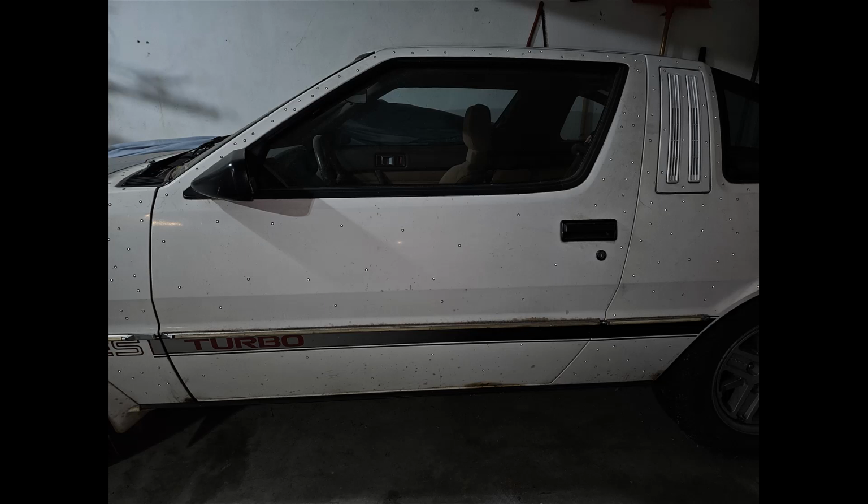Now, when we take a look at what's happening during a scan, this leaves a pretty large light pattern on the car. However, the actual view of the camera is much smaller than that. And in this case, there's only one point that's seen by the camera in this area. This means that this number of marker dots is not quite enough for us to use accurate alignment during the scan process on a large flat part.